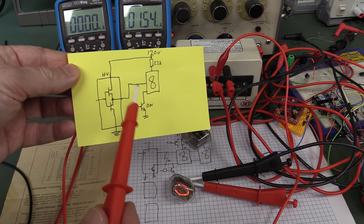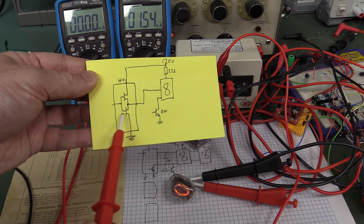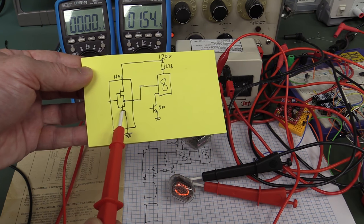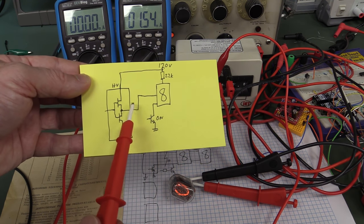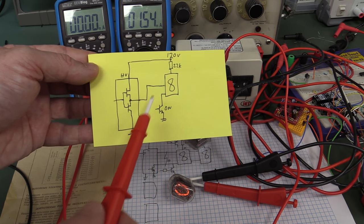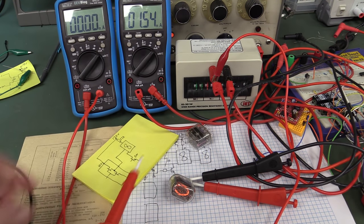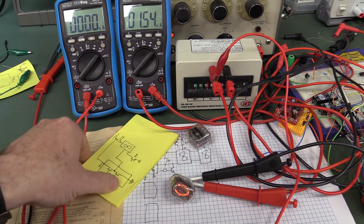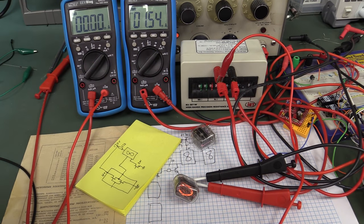just no. And of course, some of these driver chips also had a built-in current source down in here. You could actually have a bias voltage so that you didn't need the dropper resistor up here. And that's another thing which maybe you could potentially use to get away with using a totem pole output driver. So it's possible, but yeah, you've got traps like that. Just be careful how you hook it up. But anyway, I don't think I'm going to be using a totem pole output solution. So there you go. That's just a couple of extra measurements there.